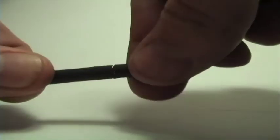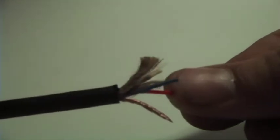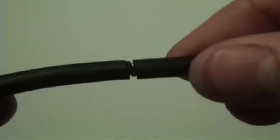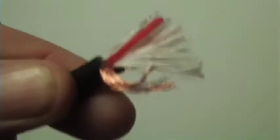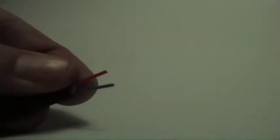This cable is made in USA. We're going to look at another type here in a little bit. Now that we've got that end off, we're going to take a look at our copper shield. This is a spiral copper shield with very sturdy copper. Here we can see a more in-depth look of our positive wire, our neutral wire, and this is the little filling agent, and here's our shield. Now this cable's made in China. I'm going to take off that end and look at the shield — this shield's still spiral copper, but the copper in this is much more brittle. The filler inside this one is a lower cost cotton, which is a very soft cotton.